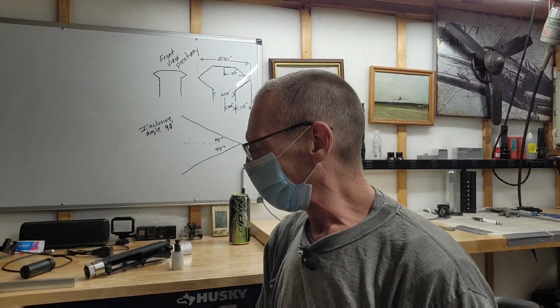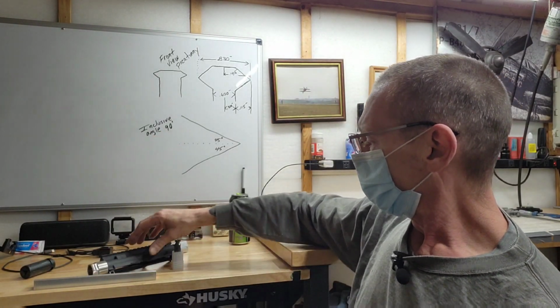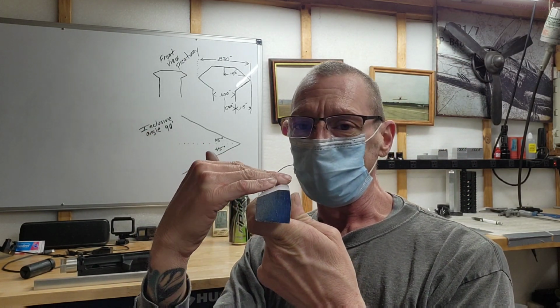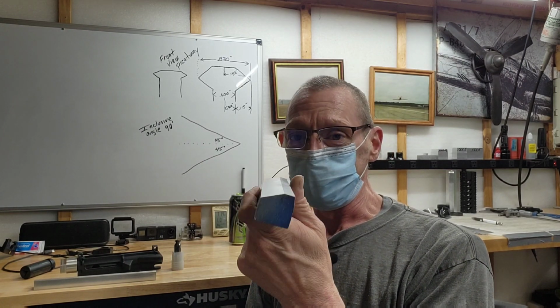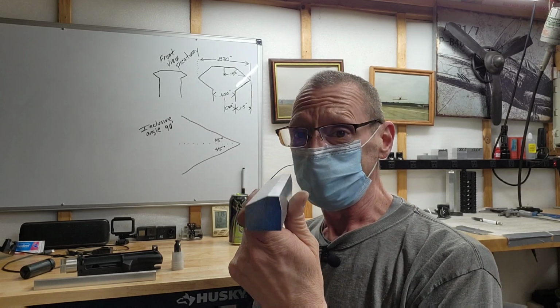So this morning I came out and pulled a couple pieces of aluminum. This one is the better piece of the two, but unfortunately I've got to mill it. I'm going to use my face mill, my face cutters, fly cutter. I've got to take a lot off of this to get it to dimensions for me to do a Picatinny rail. But we're going to cut one today, and we're going to post this video tonight.